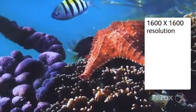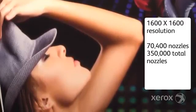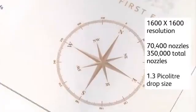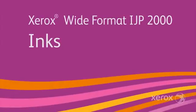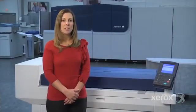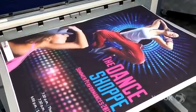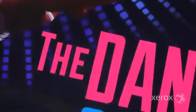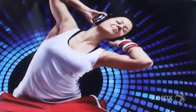The gain in speed does not mean that you have to sacrifice image quality. The IJP 2000 delivers 1600x1600 resolution. Each print head has 70,400 nozzles for a total of over 350,000 nozzles across the array. Each nozzle produces tiny drops of 1.3 picoliters. The IJP 2000 uses aqueous dye-based inks in CMYKK. The double black channel helps deliver the very dark, solid black that you see in this image.